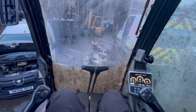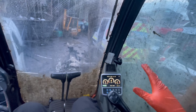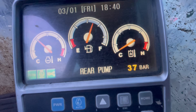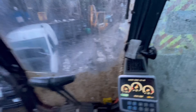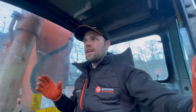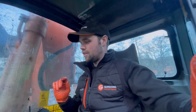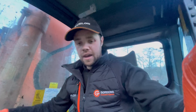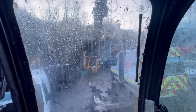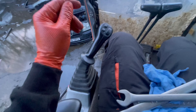I'm checking the pressures now. On screen I can show you the front pump pressure and the rear pump pressure. From factory standard, 330 bar is what I'm looking for — and we're only two bar away. I couldn't even adjust the main relief valve by two bar; it would either be ten bar too much or ten bar too little. That is incredible really. The levers do have a lot of travel but the cycle times look right enough — it'd be worth doing that knuckle to make it feel a lot tighter.